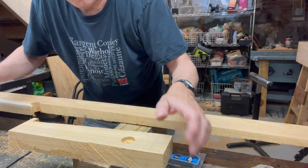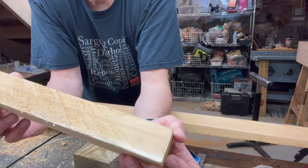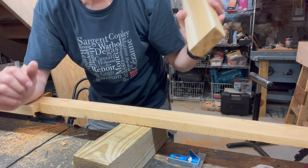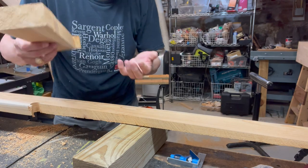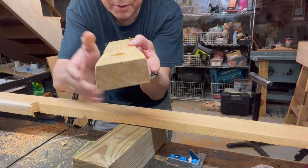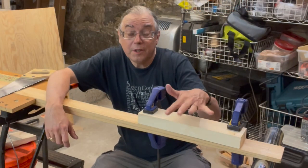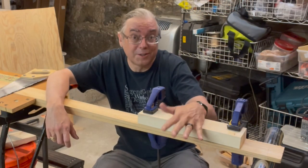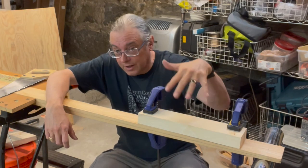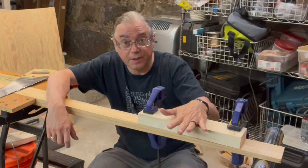I call this a success, except for one thing - you can see this really suffered. I might just go over to the miter saw and cut it. The way I made this was I took one of my shims, put it on the compound miter saw table with the shim under it, then the lid was vertical so I just cut this. I just might run that through again because I'd rather start with a good line. It was a lot harder to cut that jig than before because it was smaller and the clamping was sketchy. So I got another two-by-four, cut off a section, and made the sketchy cut - I'm not happy with it. I want to really try hard to not damage this one, but we'll see.